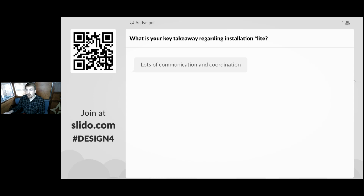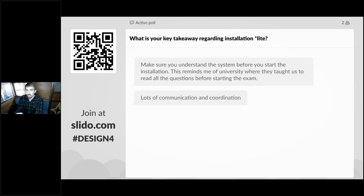There is not. Let me think about it for just a second. So you're talking about the final stage tank being the hottest tank in the primary storage. If the heat pump is dumping water directly into that tank versus dumping water into the line that exits that tank, you should get the same effect as long as you're talking about dumping it into the top of that final tank, right? So oftentimes there's not an actual connection there, so people will plumb directly into that final tank outlet between the primary storage and the swing tank, which is totally fine. You just need to make sure that the installer doesn't have a check valve there, for example, that doesn't allow that water to flow backwards into that primary storage.